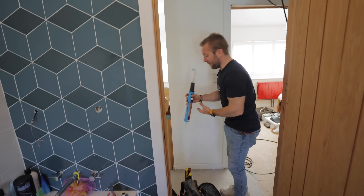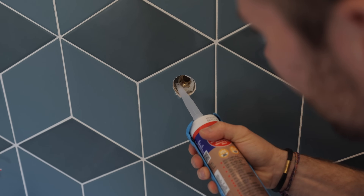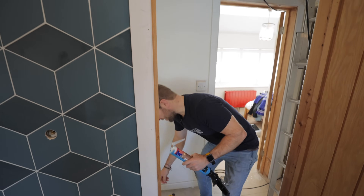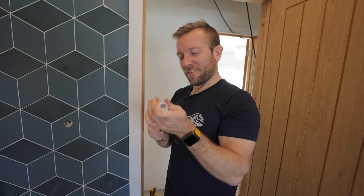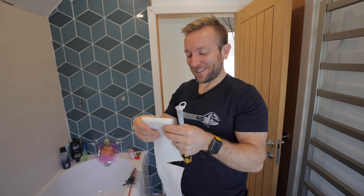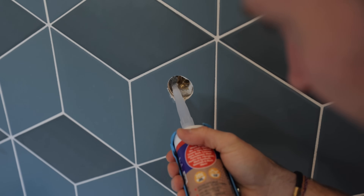The plumber's AK-47 - silicone. Usually I'd put in the brass piece first and then gunk around the brass, but I can't do that on this job because of the shroud. So we're going to get that in there and puggle it about so it pulls through. The reason I'm doing this is just making sure we don't let anything through - water ingress into the wall.